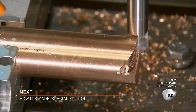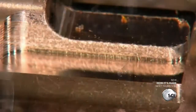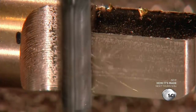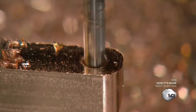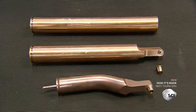Smaller electrodes are made of partially hollowed blanks. They shave down the blanks so that it will be able to weld in small areas, and also shape it so that the electrode cap will fit on top. They use another drill to make an entrance for cooling water, which intersects with the hollow part of the cylinder. Then another machine bends the electrode into its final shape.